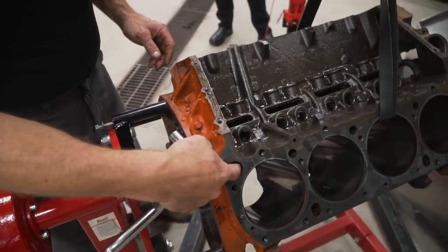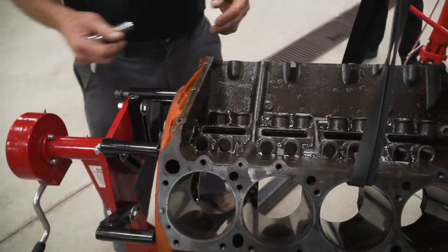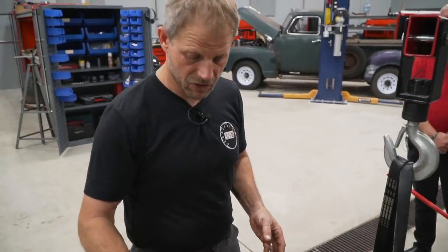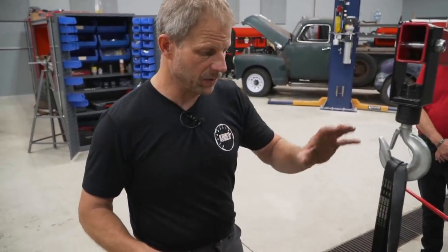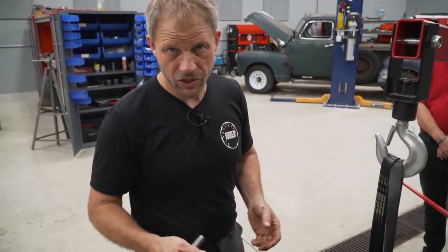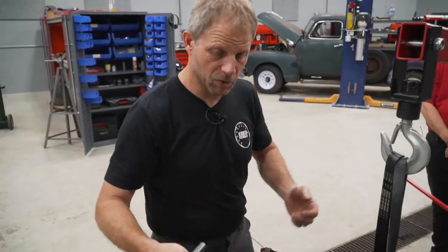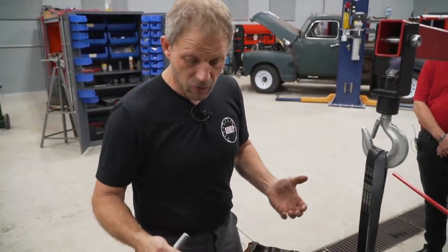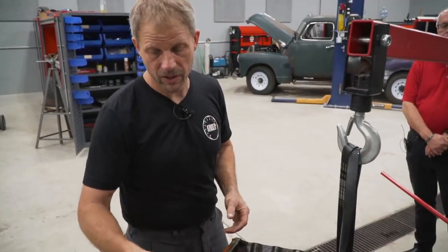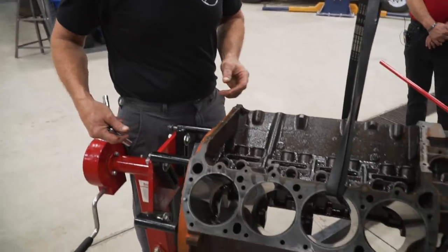Obviously, we're going to get water up into the water jacket, so it's going to flush some of that out. And keeping that in mind, when I'm doing a final assembly function, my intention is to be able to put this into the parts washer and do that final wash without having to run all the brushes through there. So I'll probably have to do some of it just to keep it loose, but all that spraying will loosen everything up, specifically in your water jackets, and flush all that rust and nasty chunks out.